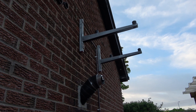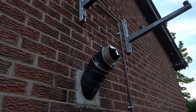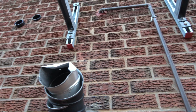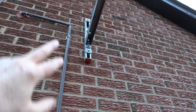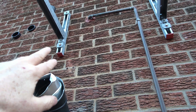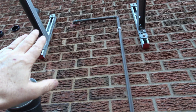There's the bracket up and there's the flow and return coming through the wall. I thought I could do it without taking down the flue but I couldn't. There's a fixing top and bottom of each of these heavy brackets, and you want to go into brick — you don't want to go into mortar — so it was quite difficult to get a position that would allow me to do that.